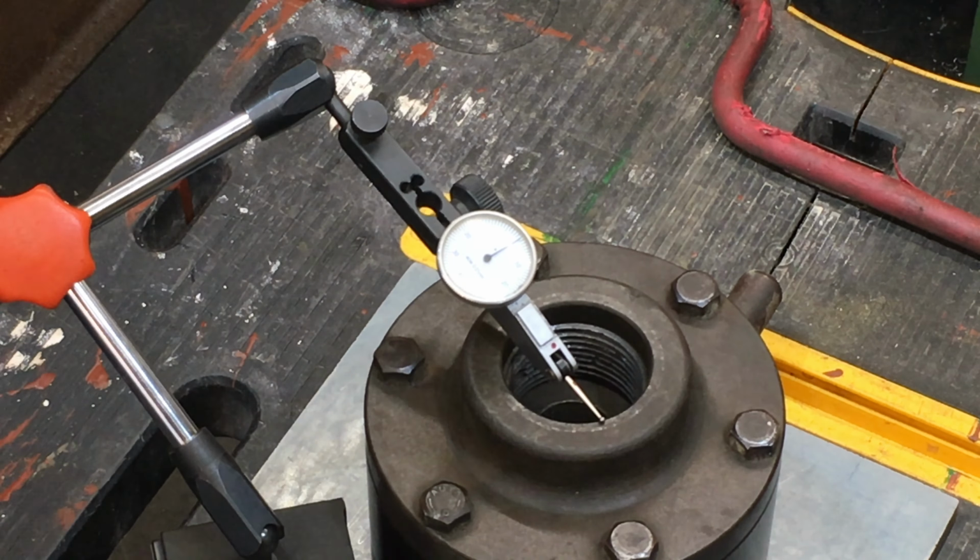I had to clear the vomit-inducing crud from its seating before I could find out how far out the chuck face pads really were. As before, I used my best stones to clear the joint face. The bad smell started to dissipate after I used a bit of diesel as a stone lubricant. Well, it'll probably not surprise you to hear that the pads also varied by 2.5 thou. Not surprising considering the scars.